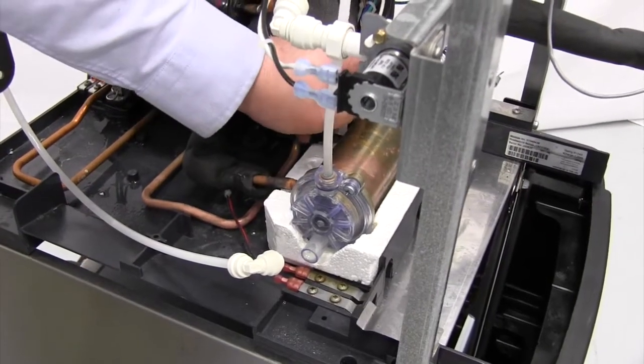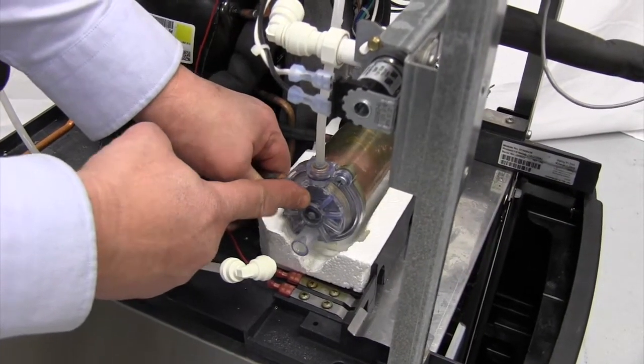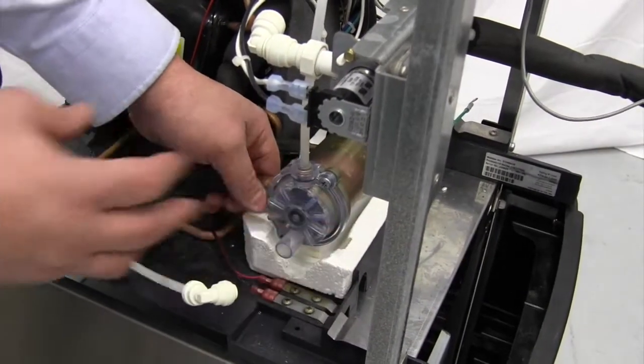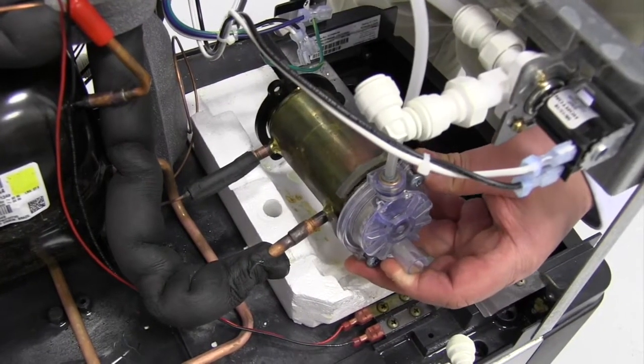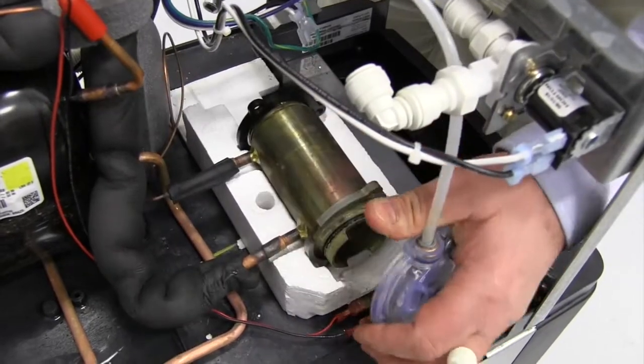While the evaporator is torn down in this state, if you need to replace the bushing housing, we can simply unscrew the bushing housing from the retaining flange and replace this piece as well. With the two screws of the bushing housing backed out, the bushing housing should come off easily.